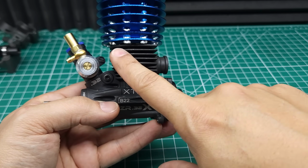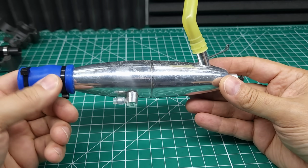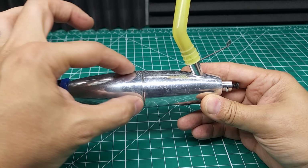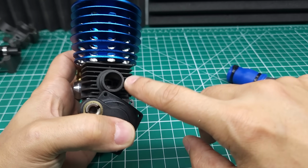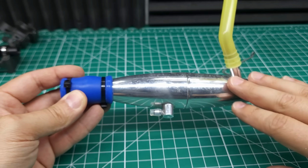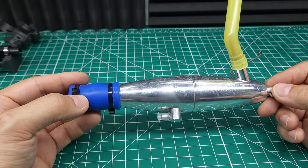To prevent the engine from just pushing all the fresh charge air right out the exhaust, we have a specially designed exhaust chamber where each exhaust pulse comes out and then is reflected back. That back pressure actually keeps the fuel air mix inside the cylinder. The timing of when that happens is really, really important, and so these exhaust pipes are designed specifically for that timing.